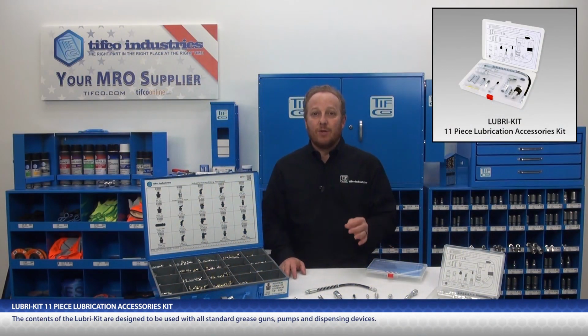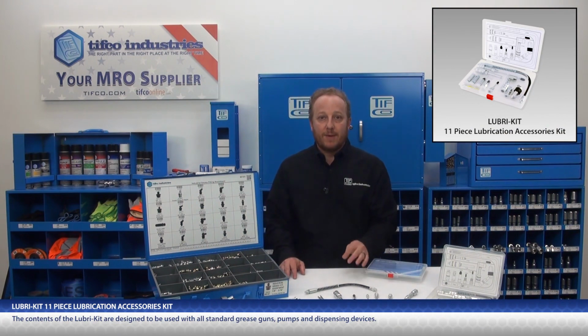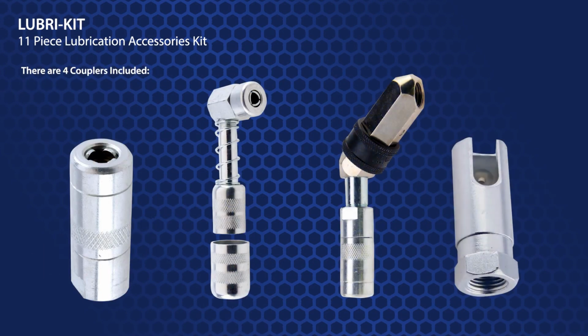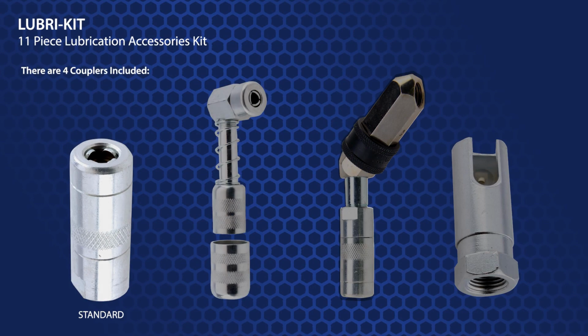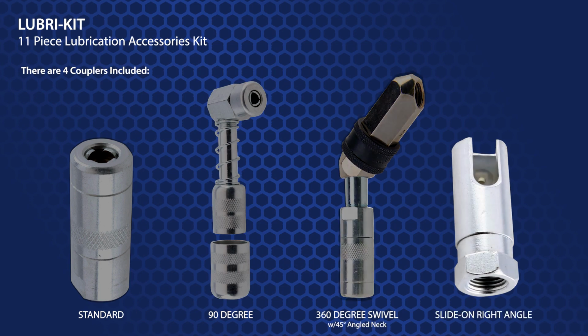The contents of the Lubri-Kit are designed to be used with all standard grease guns, pumps, and dispensing devices. The Lubri-Kit comes with a 12-inch whip hose that features a protective spring for strain relief. There are four couplers: a standard, a 90-degree, a 360-degree swiveling version with a 45-degree angle neck, and a slide-on right-angle coupler for tight spaces.